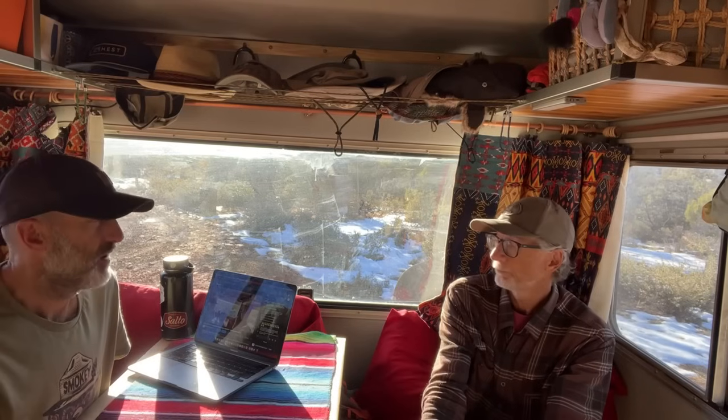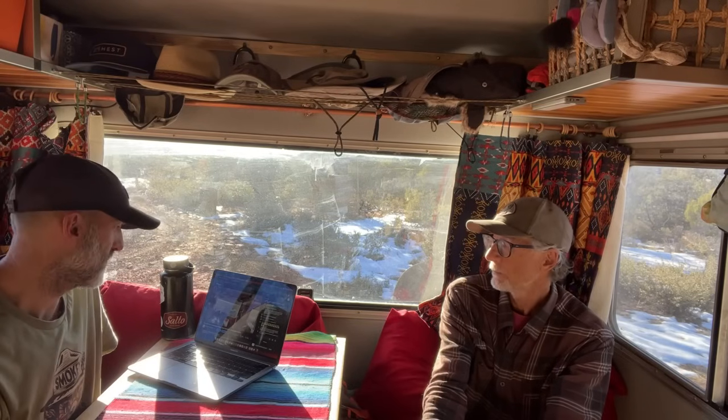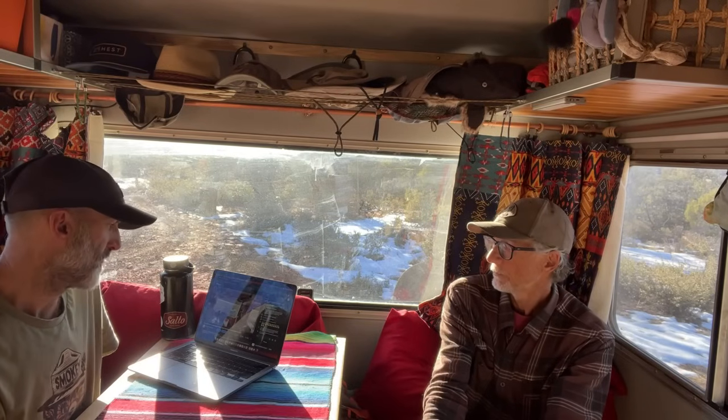See how it lives, because that's what I did here. I actually camped on my property for a year in different spots to see how the weather hit it and where the sun would be for solar at different times of the year. Make sure you've got a south-facing slope for solar in the wintertime if it's hilly. If not, you're going to have to figure something out. Figure out where your winds are coming from, how bad the winds are, and what you're going to need to do to deal with that. I would definitely recommend all that stuff.